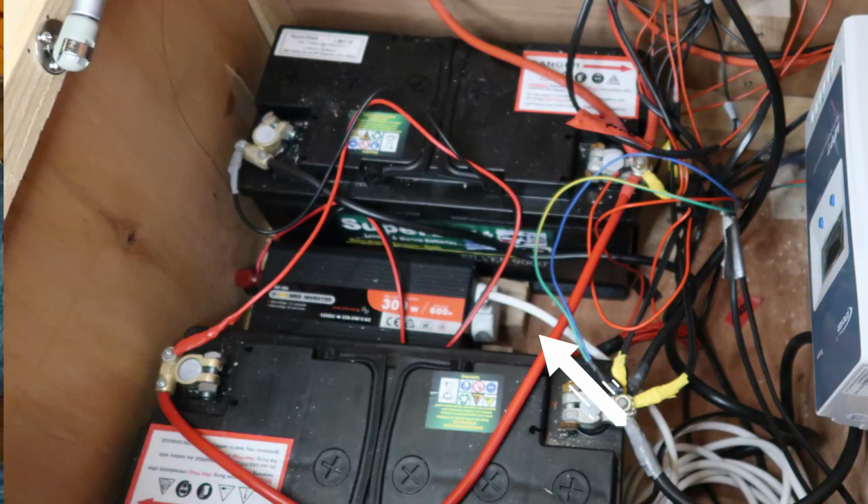In order to ensure our batteries didn't go anywhere, we made sure we drilled down some wooden boards right beside the batteries to keep them nice and snug. This is a big safety concern for the person that was helping us with our electronics, and they also recommended putting down a rubber sheet on top of everything so the batteries don't get touched while we're driving. To do that we used one of our old gym mats, which is a rubber floor mat, and it makes everything nice and secure.